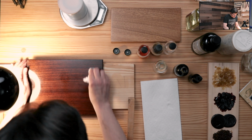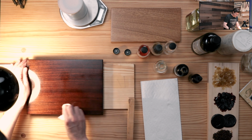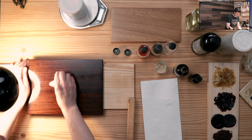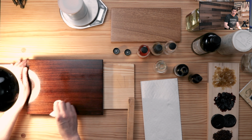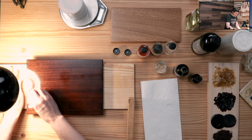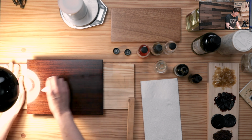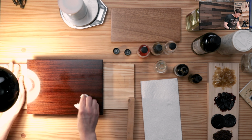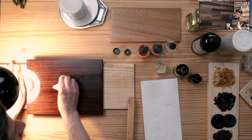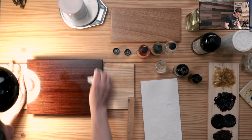This is very dry, so I can immediately start applying pressure. So when it comes in, I'm moving faster. I'm not doing a lot of pressure because I have to assess how much, I'm gonna call it moisture, but you know, it's alcohol and shellac. How wet is that pad? This is very dry. So as soon as I came in and realized it was pretty dry, then I start actually making a lot of pressure. And I'm pushing probably way harder than you might imagine on this.